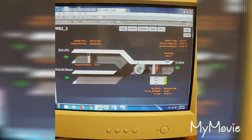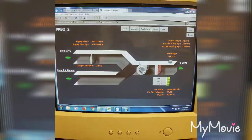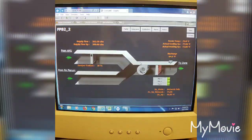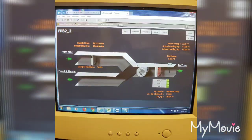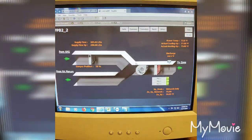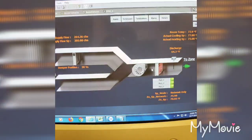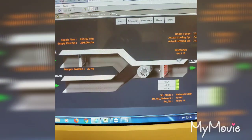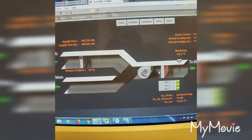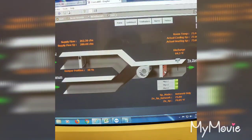Like I said, I'm making this particular video at the end, but I think I'll put this at the front to start it off, because this is where you should start your troubleshooting: at the front end, or your thermostat, to make sure it's calling. Oh yeah, another thing, I think I'm going to show an airflow switch that reads the static pressure. If it's not sensing that static pressure, that your fan is moving air across the heat, it would not work.